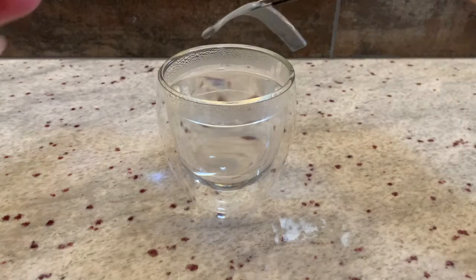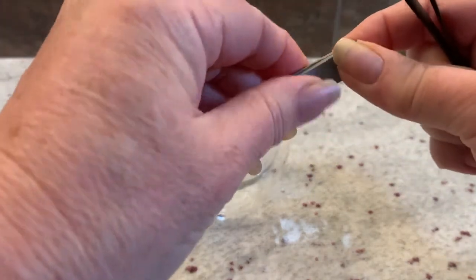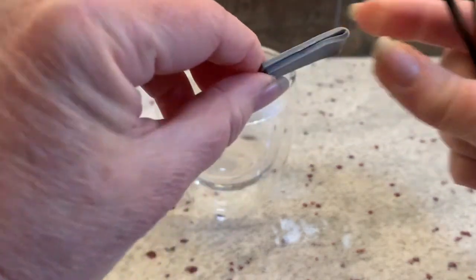There are a couple of neat post-processing options. Models can be wet sanded to create a smoother surface and can also be dipped in hot water — about 70 degrees Celsius — for easy reshaping. And you can do this more than once, which is very cool.